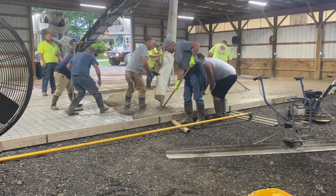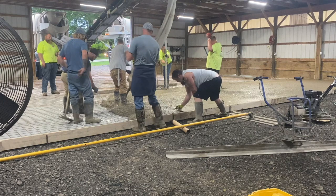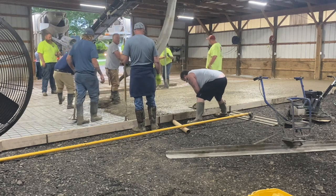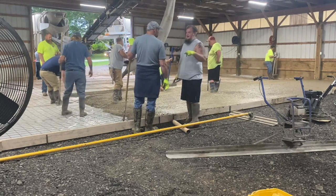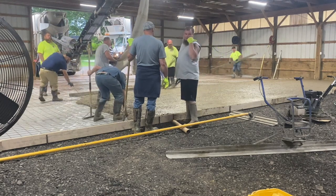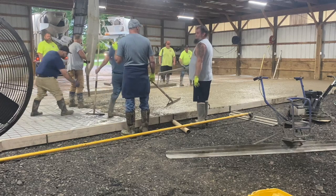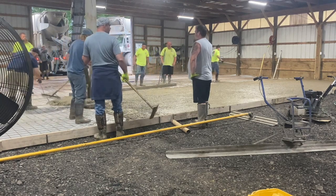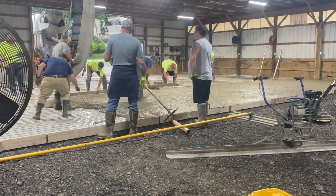The wire mesh policeman can't arrest me on this one — we actually pulled the wire up. You walk on the wire, it's inevitable, but the stones in the concrete will actually hold it up in there, which helps the strength. This is 4,000-pound concrete. Normally when you pour a little thicker it holds the wire up better. In a minute you'll see we dump the whole truck out, and then I'll show you the second truck and how nice that concrete was.